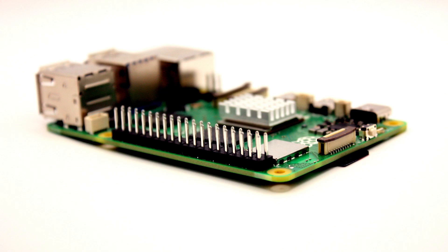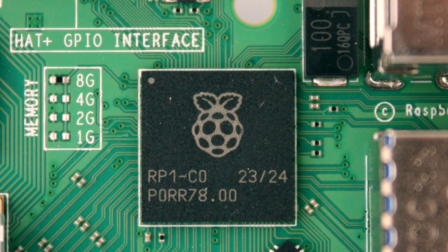On the fourth long edge of the Raspberry Pi are the ever-present GPIO pins — these are what you can use to connect to all kinds of other electronics, effectively the Pi's interface to the outside world. The other really major addition to the Pi 5 is the Raspberry Pi RP1 chip. This is a chip that controls all of the I/O on the board. Previously the CPU had to deal with all I/O itself; now it's got a little companion chip to offload some of that functionality, meaning the Pi 5 can cope with far more I/O than the Pi 4 ever could.